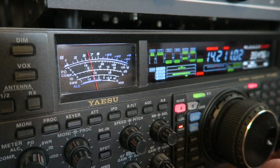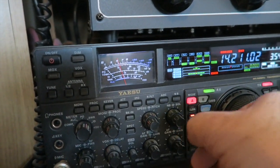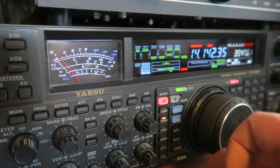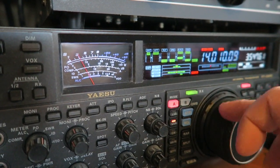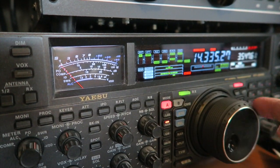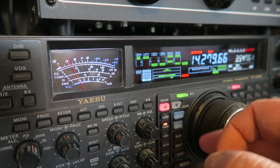There we go — about 2.11 and it's about S7 on my meter. Let's switch them on and see if it makes any difference. They're both switched on now, and I don't think — I'll find out when I review it — I don't think that's made much difference at all. Going down the band, I certainly don't hear any big blocks of interference. Going up the band, I haven't seen any of those spikes of 20 over which have been reported. And just remember the close proximity I've got of the PLT and my coax — they are literally within one and a half feet of each other.